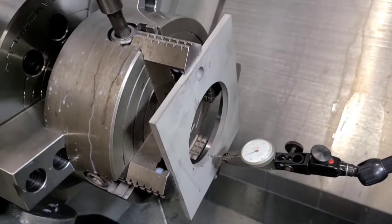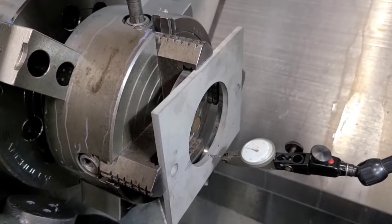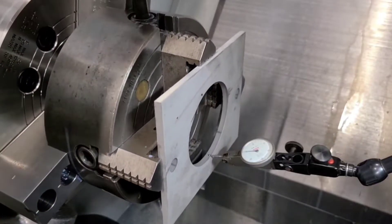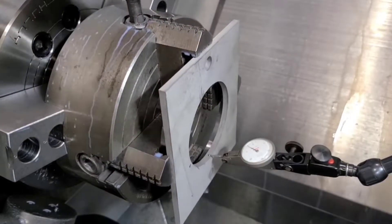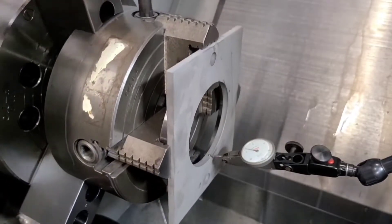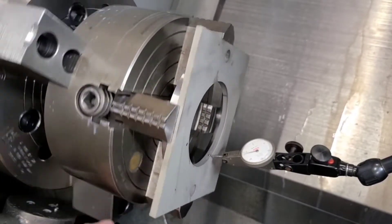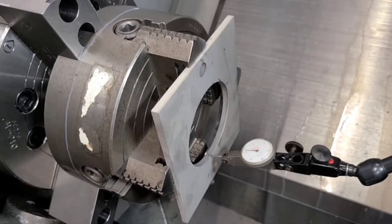The final step is to ensure all jaws are tight. Come to each jaw and apply pressure. This is a little easier when you have a part that is truly round on the inside to see perfect run-out — we're just not going to get perfection with a rough blank like this. The surface finish and roundness of a water jet blank won't allow it. We're within a few thousandths on a five-tenth indicator.